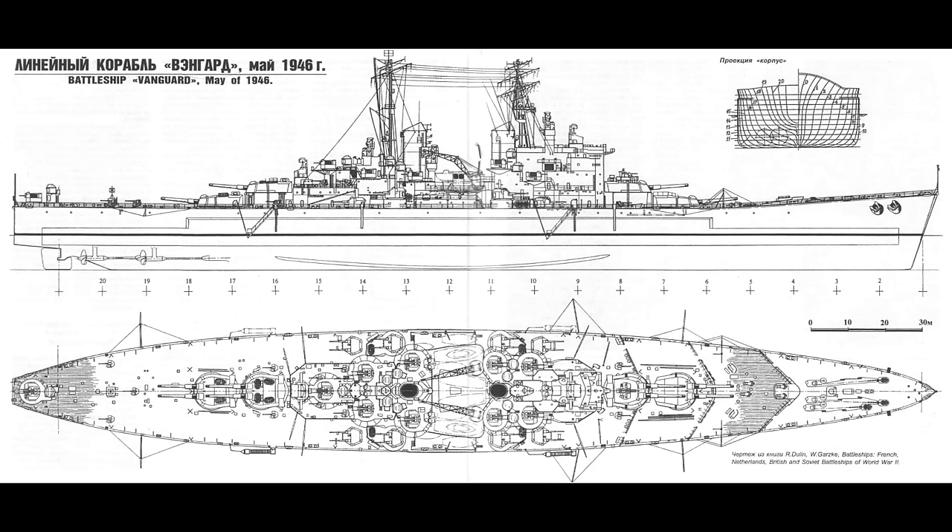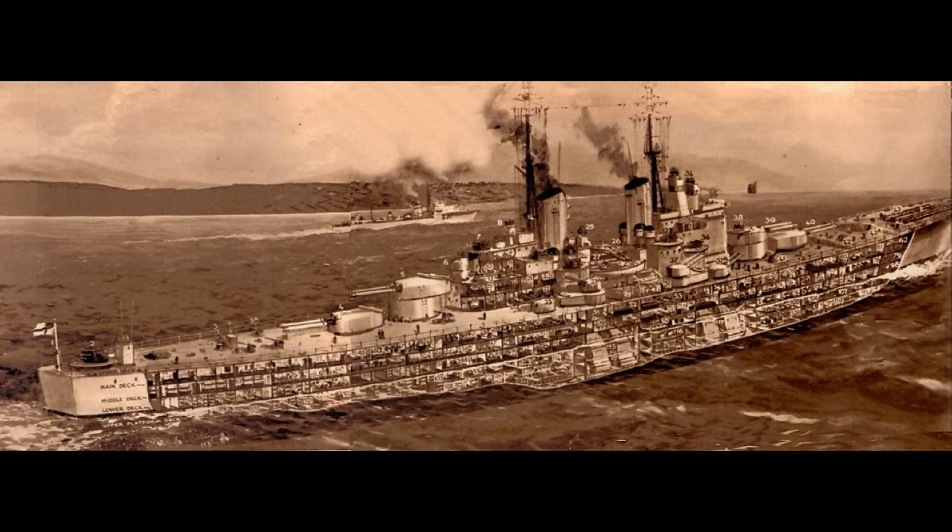All of them would have a range of 14,000 nautical miles at 10 knots, and a complement of around 1,600 men. A slightly larger revised version called 15D, with a displacement of 41,200 tonnes, a maximum length of 809 feet, a beam of 105 feet 6 inches, a draft of between 30 and 33 feet, 130,000 shaft horsepower, and a speed of up to 30 and a quarter knots, was chosen — with the secondary battery being nominated as 16 5.25-inch guns in twin turrets, the same as was planned for Lion and had been installed on King George V.